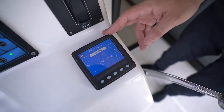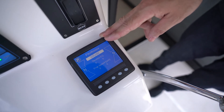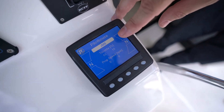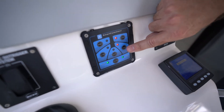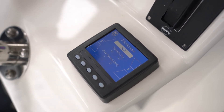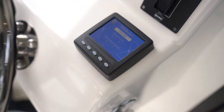The V-CAN display is not only for monitoring — it also displays what mode is active and at what time. Cruise mode represents clutches fully locked up using the throttle levers. By taking command with the joystick, you will see two green lights active in command at the joystick, represented on screen as JMS — Joystick Manoeuvring System. It will do the same for accessing Auto Troll mode and other functionality; the V-CAN will represent what mode is active. The vessel is stationary for this demonstration, but while commanding the joystick or levers, propeller shaft speed will increase, shown on the V-CAN.